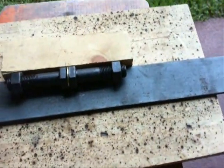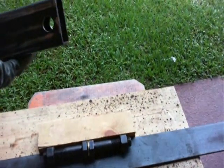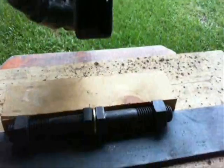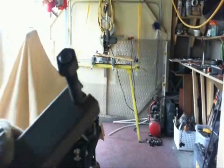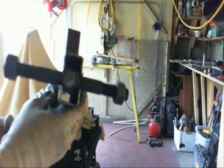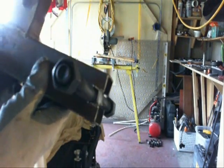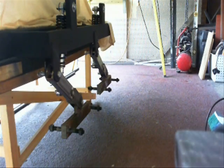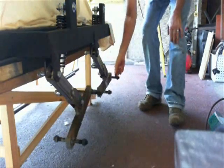This is how I built the axles. I used two 5/8 inch bolts — on the feet I drilled a 5/8 inch hole, then notched it out and welded the two bolts together with a washer in between. That gave me the exact width needed to slide into the end perfectly. I slid them in, welded them up, and welded caps on the ends. Here it is installed.